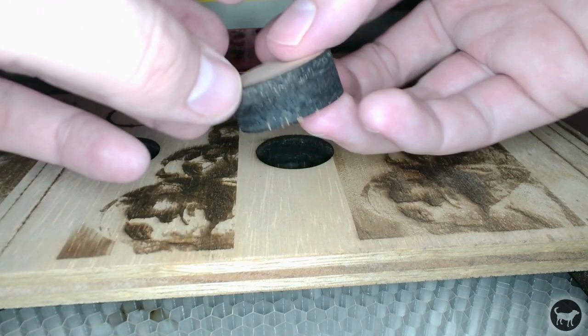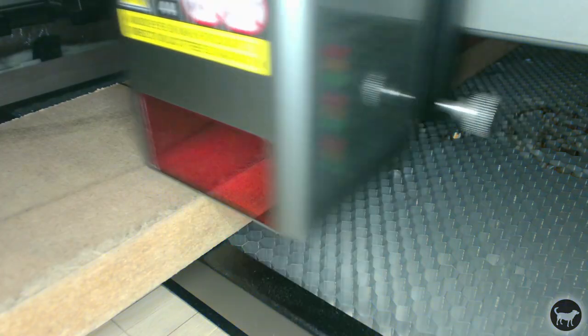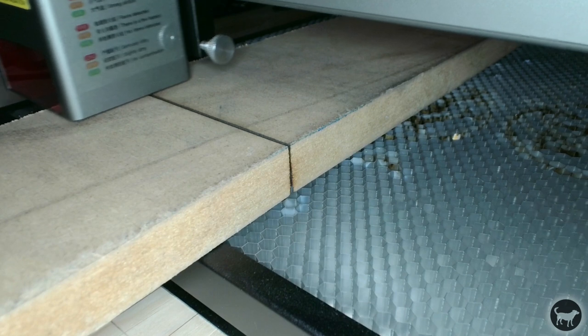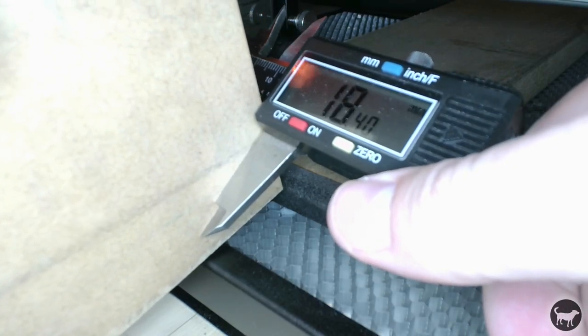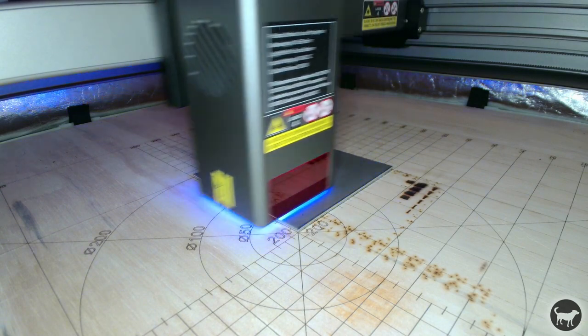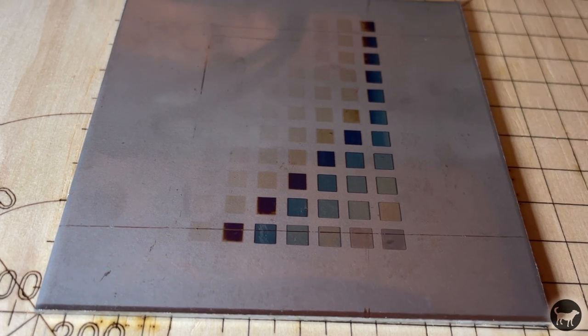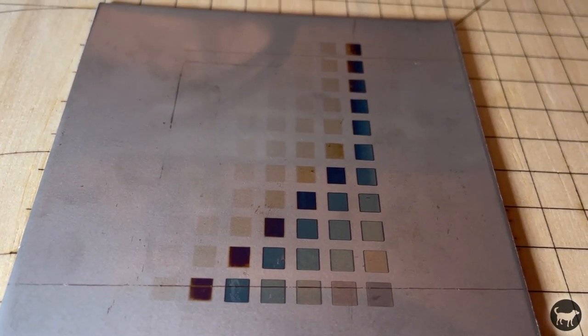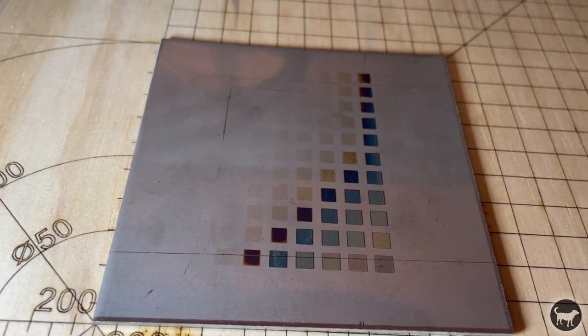I was able to cut through this half-inch plywood scrap at 400mm per minute at 100% power in three passes. It worked just fine without burning the wood too much or creating a lot of charring. Just for fun, I also wanted to cut into an over 18mm piece of MDF, and I cut through it in five passes — it worked just fine. So this machine cuts and engraves just as I would expect. I even ran a pass on some stainless steel to see what colors I was able to get, and with a little more testing, I should be able to come up with even more. I ran a test from 1,000 to 11,000 millimeters per minute, and you can already see some colors coming out directly on the metal.